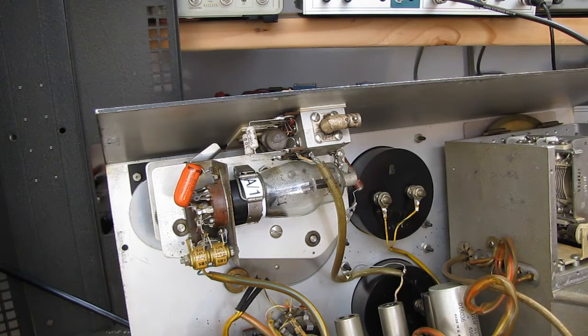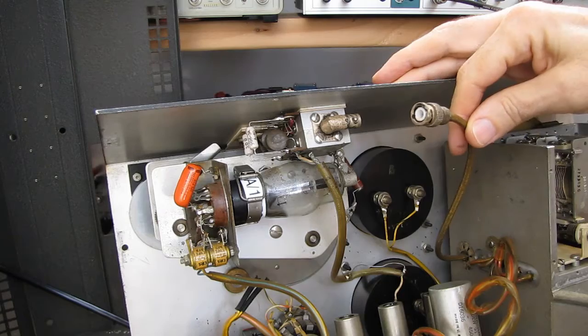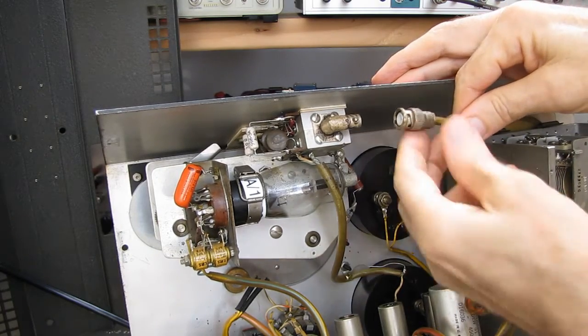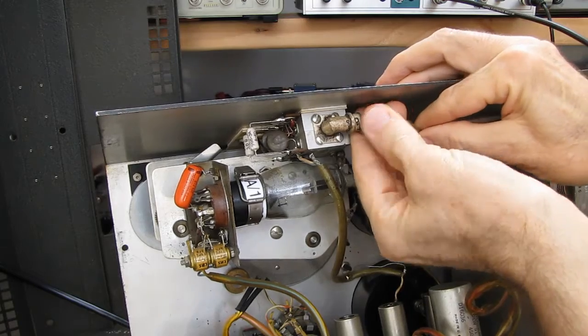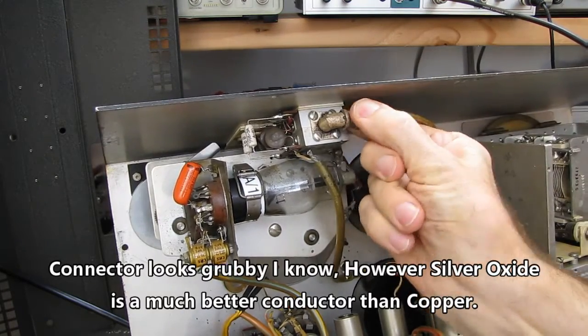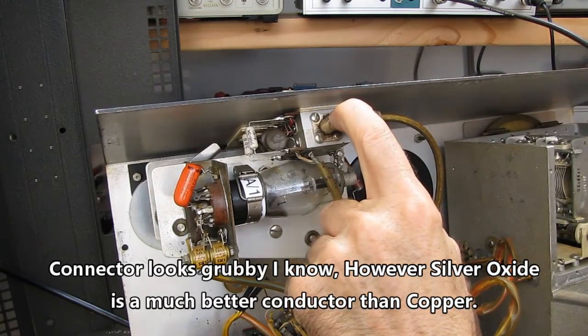The oscillator's not running. Don't worry about the oscillator. You can fix that. That's not a big deal. You just saw me fix it. And there's dozens of these out there that don't work. If you need parts, you can scavenge parts out of the turret. So if it has continuity internally here, the thermocouple's probably fine.